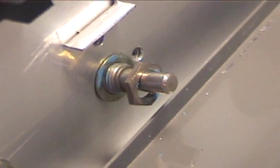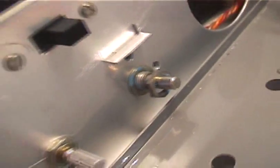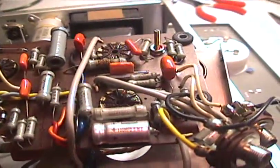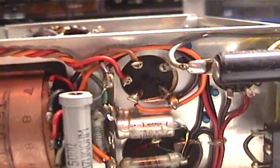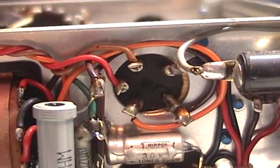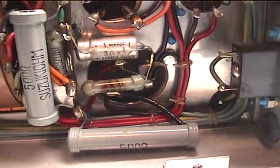That part is held on with the blue-coated washer and nut. Ready to put a 47 microfarad in place of an old 30 microfarad. Look at the progress — I've got most of them replaced except for that one and that one on this board. After I do the ones on the other side, I'll have to then do the whole thing on a whole other amp. Here's a shot of this part. You can see the colors of wires that go to that capacitor, and for the capacitor below it, you can see the colors of wires that go to it.